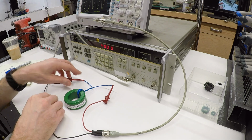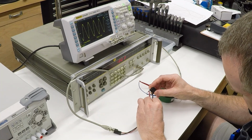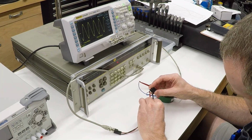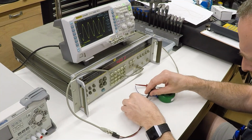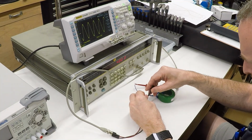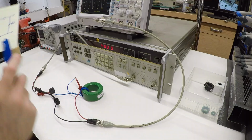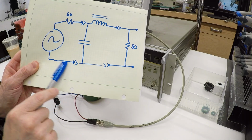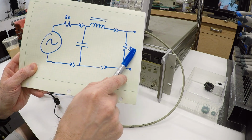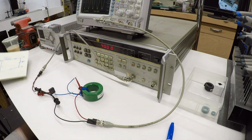And we'll just connect it between the ground and the upstream side of the coil. See if I can do this. The answer is no, I cannot. There. Okay, so all I've done is attach this capacitor across here to shunt the higher frequencies around this circuit rather than through that resistor where we're measuring the voltage. And let's see what happens.